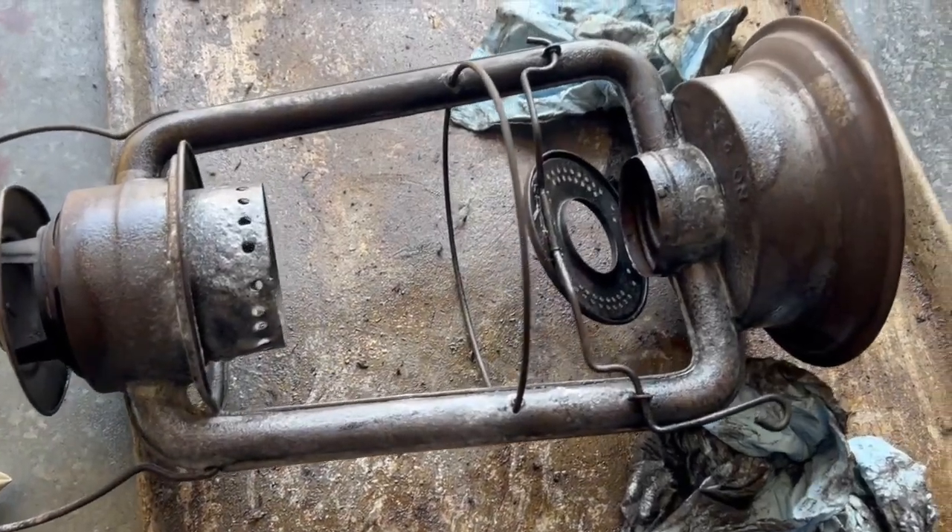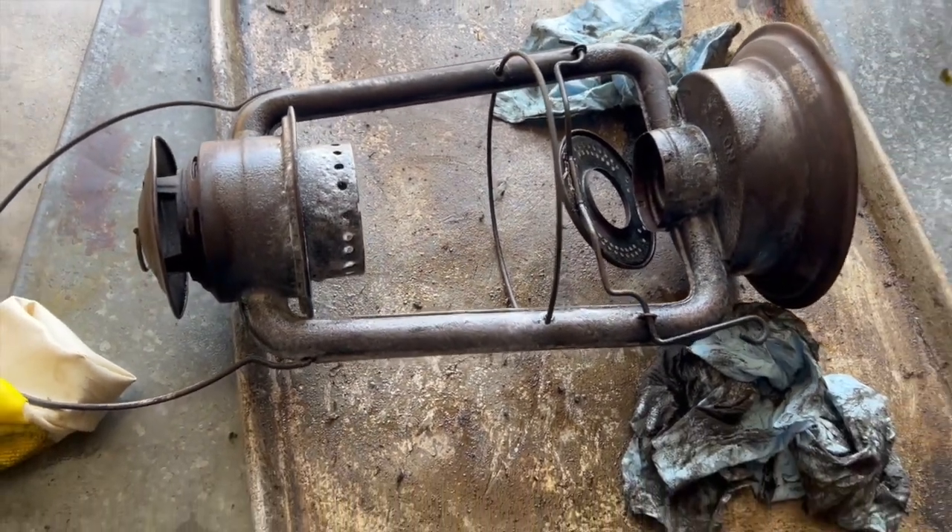When you have just gray pale metal with pits it looks really weird — I don't think it's a proper approach for antique lanterns. If you have perfect metal under there then that's fine. There are different types of rust we come across — some are very fine and won't pit, but other rust is more aggressive and will pit your metal. When you get the paint off you can proceed how you want, how far you want to go. Some people will use boiled linseed oil to coat the lantern and protect it from further oxidation. I don't like the wet look, so I wipe it down with WD-40 and scrub it a little bit.